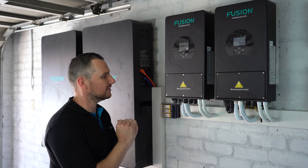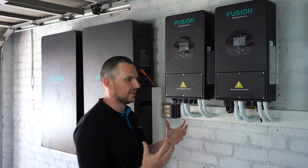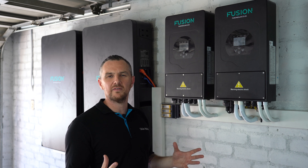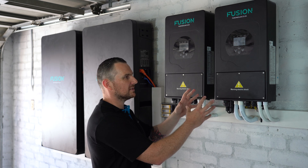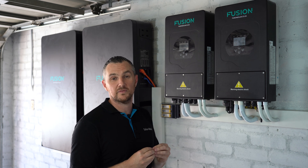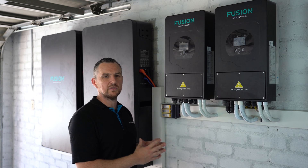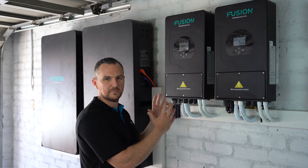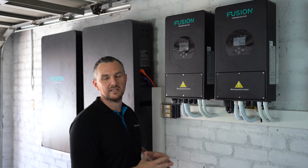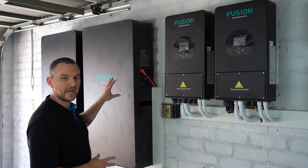There's no point running things at night because I've got the sun to power them. So I started with the 5 kilowatt inverter and as my needs grew I got more appliances and it kept tripping the system — exceeding that 5 kilowatt limit. These inverters can handle more than that but only for a short duration before they trip for safety so you don't blow the inverter. We added another one and when you stitch two inverters together like this it's called parallel — five plus five gives ten kilowatts of capacity.